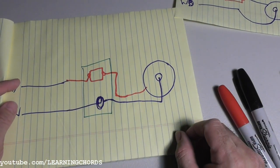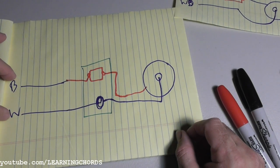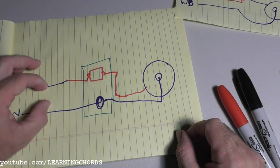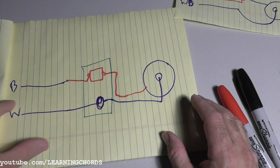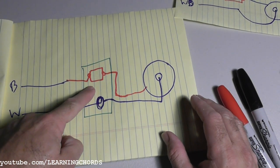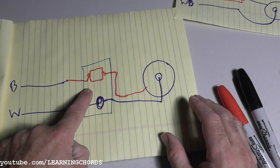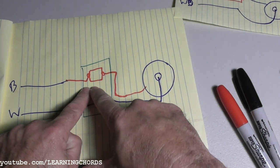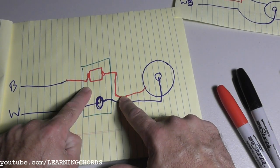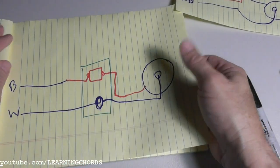Just to add — if you've got your wiring, you're usually going to have a ground. You're going to have your black, your white, and a ground wire. It might be green or it might be a bare wire. All three of those wires should be in one jacketed thing — either Romex or however you're going to do it. Your ground wire goes into the box and is connected to a screw on the box, or it could be set in a wire nut and go through the sheathing to connect the ground over to the lamp. So we understand the basic on-off circuit now.